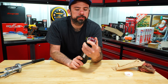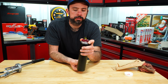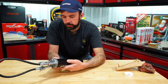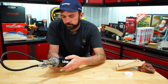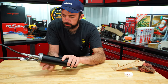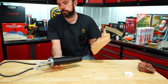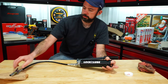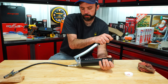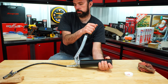Let's go ahead and see if this works and how easy it is to prime. By the directions you're supposed to just insert the cap there in the tube, push it until the grease starts to come out a little bit, and then of course screw it in here. I'll hold the grease gun loosely and push a little more on that follower plate, then back on the handle there as I screw it in.